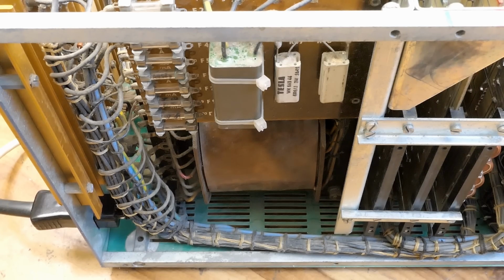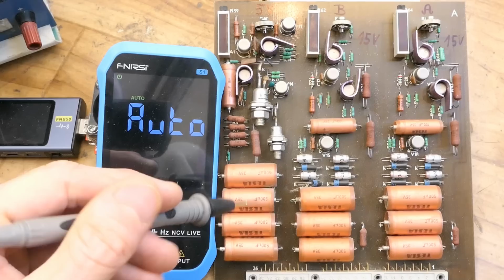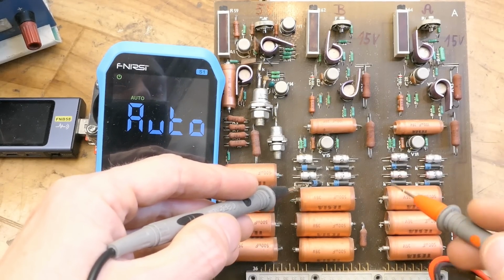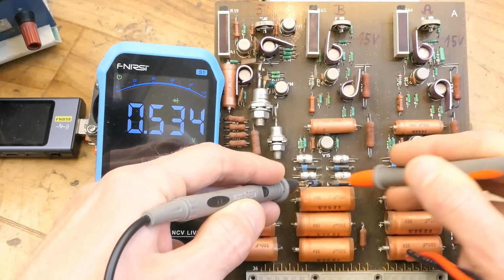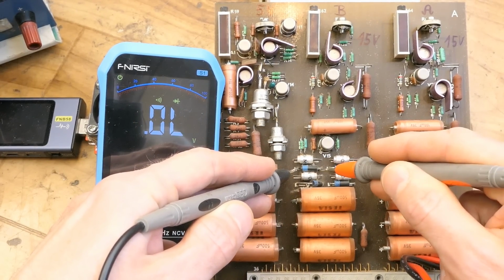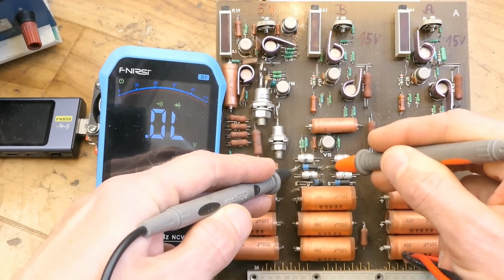But if you actually hear a 50 Hz buzzing, it means that there is some DC bias, some DC current superimposed on the AC current, or some imbalance between the half cycles. And there is more current in one half cycle than in the other. It sounds like a transformer loaded in just one half cycle, and it made me test the diodes in the bridge rectifier. One diode half a volt, another diode half a volt, this one again half a volt, and this one? What the hell? It's open circuit!